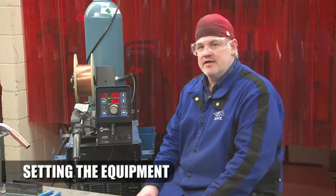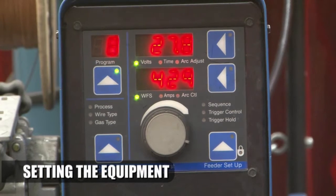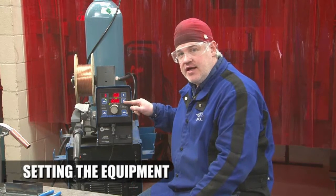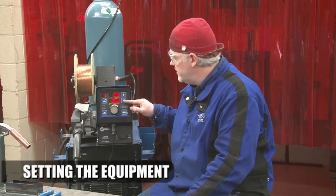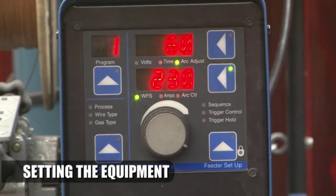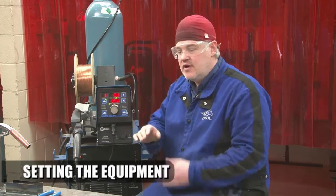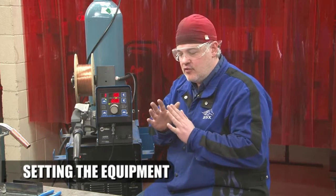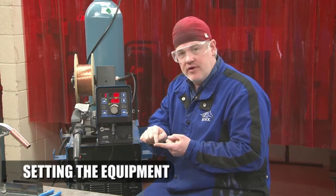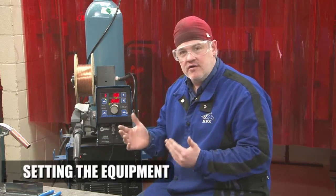I need to pay attention to two controls on the machine: wire feed speed, and my heat reference number — in this case called arc adjust. We're on a pulse spray program. The wire feed speed is currently 230 inches per minute, and our arc adjust is at 60. Arc adjust lengthens or shortens the arc length — where the wire is burning off in the pulse spray process. The higher the arc adjust number, the higher the arc will be and the wider the puddle. As I decrease arc adjust, the wire burns off at a lower point and I have a much shorter arc length. We'll run a demonstration to show how arc adjust affects arc length when welding.